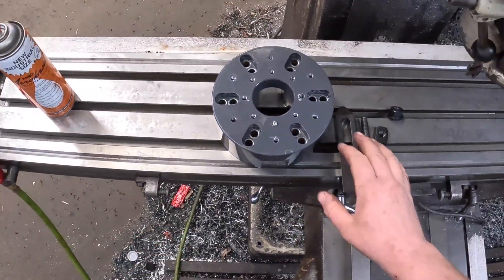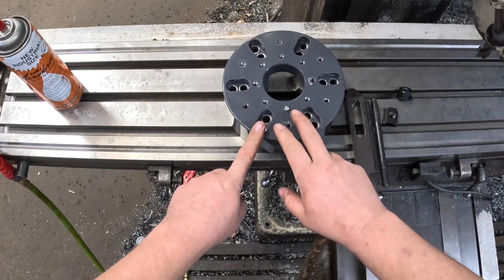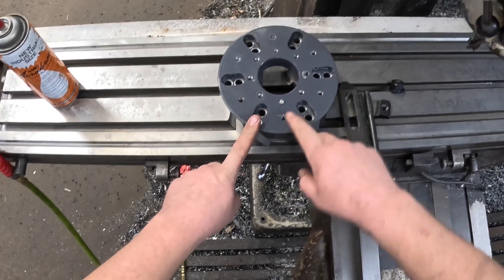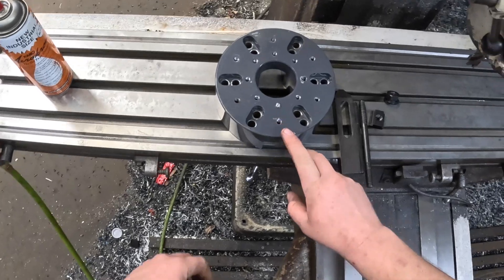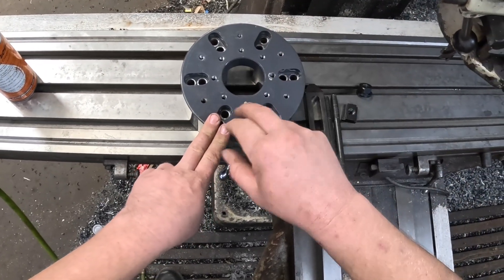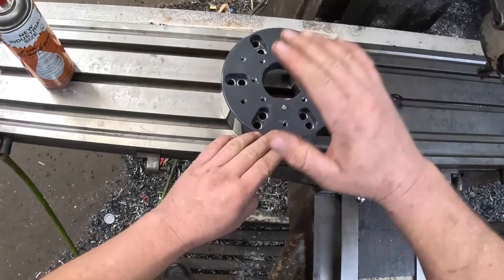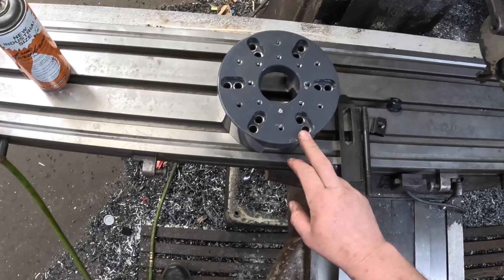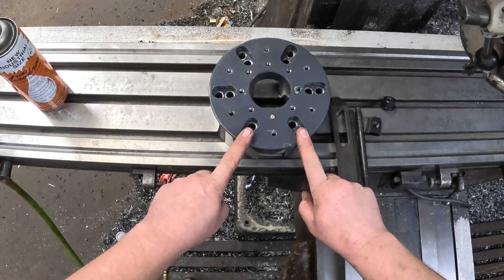Welcome. We're talking about pulling out a broken bolt — it's an M8 by 1.25. I checked the thread earlier. One thing that really helps is knowing how it broke: whether it got broken on the way in, the way out, got cross-threaded, or snapped by shearing off. Those sorts of things can give you an indication of what you're dealing with.